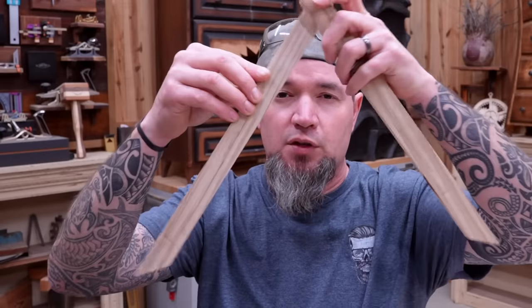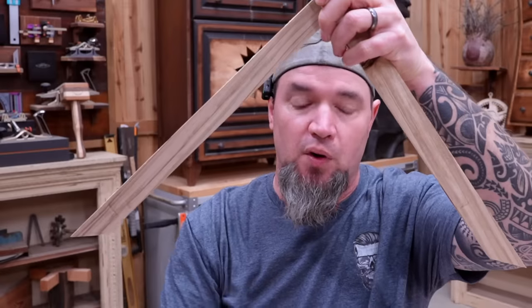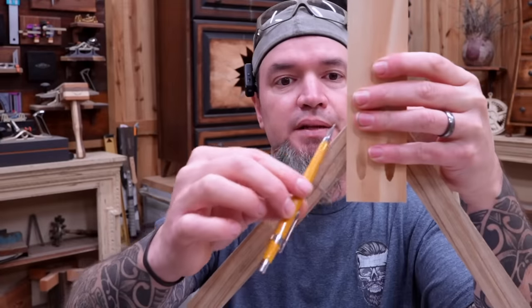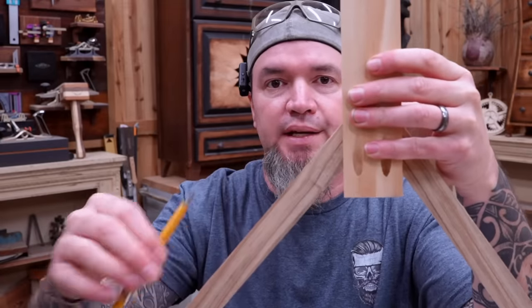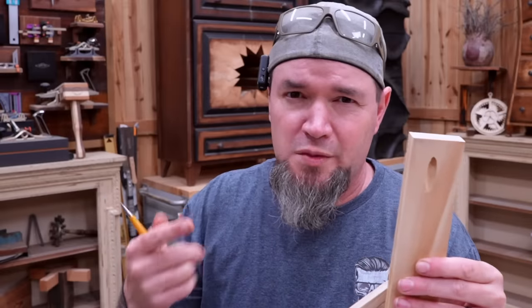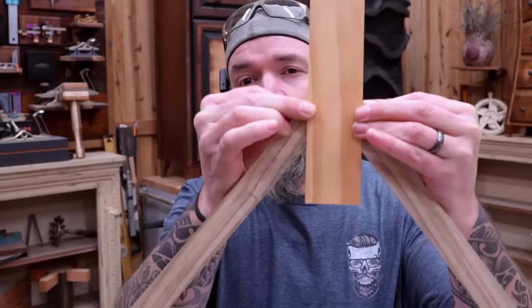How did I come up with 50 degrees? Just kind of playing around. I took the span of the base that I wanted — right around 22 inches — took two pieces of scrap, angled them in on a flat surface until they were 22 inches apart, then took another piece of scrap that is two inches wide (the same width as our center board), placed it in the center, and just marked one of my edges. Took it to the miter saw, found that edge, and it was 50 degrees. There are several different tools you could use to find this, but this only took me about a minute. Work smarter, not harder.